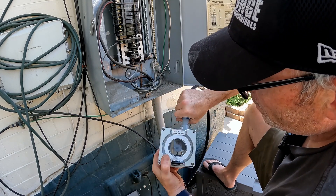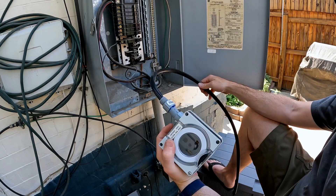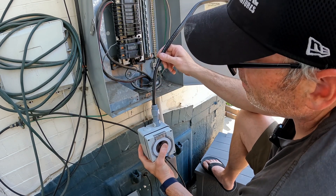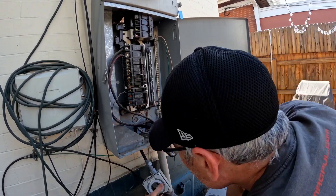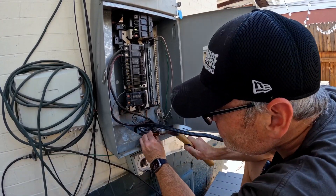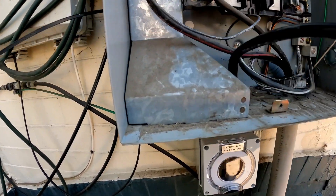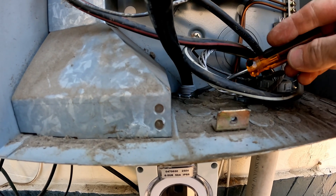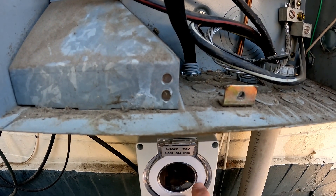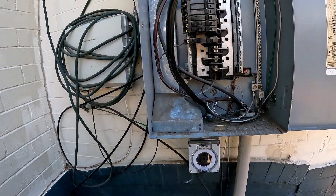This is also not tightened all the way down, but it's pretty tight. We'll tap that nut tight once we get it all in place. So now we'll figure out the length of this wire — we're going to run this in here, twist the wire around, figure out the length, and give it a cut. I was using the hammer and a little screwdriver to turn this little lock nut. Now this thing is in place and not going anywhere. I think we're still going to put a screw in it just to be safe, attach it to the wall. Now we're going to run this and cut the wire and hook it to the breaker.